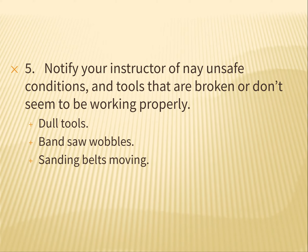Number five: let me know if anything looks unsafe as far as tools. Remember — looks weird, smells weird, sounds weird. Looks weird means a machine or tool showing a lot of wear, getting really dull, or has a chip out of it. Smells weird usually means it smells hot, which means it needs a belt replaced, oil, or grease. Sounds weird usually means it's squeaking or squealing — again, usually something needs oil or grease. So let me know about those things.